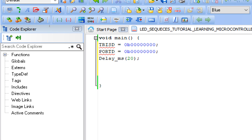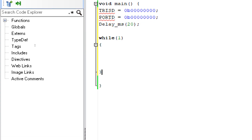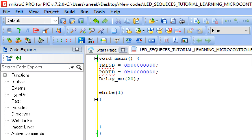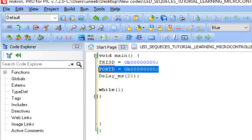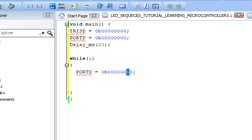Now our LEDs are initialized. Write the forever loop: while(1). Inside the loop, I use the bit technique to set the initial state. We have 7 LEDs on pins D0 through D6. D0 is the bottom-most LED, D1 the second last, D2, D3, up to D6 — D7 has no LED so it is floating. In the first step, I turn on the center-most LED. With 7 LEDs total, counting from 0: D0, D1, D2, D3 — D3 is the center because there are 3 LEDs on each side. So in the first step, the center LED at D3 turns on.